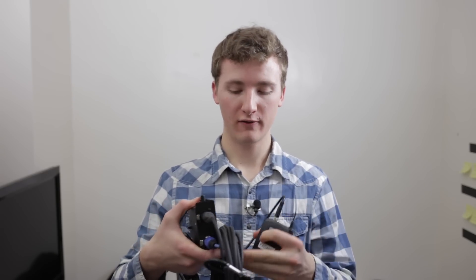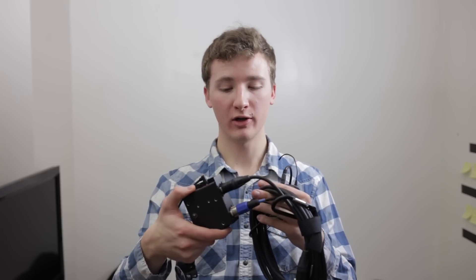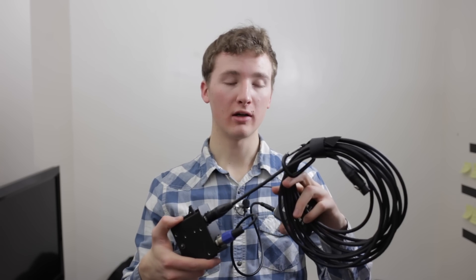It sounds great that way. You can dial in and adjust the sound and monitor it through the 3.5, and it works great for the ceremony. If I'm running the G3 to the officiant and they have mics and system sound, I can patch in on the other side — Sennheiser into the left channel, and on the right I run XLR using connectors to RCA or whatever their mixer board has. So I get clean wireless audio from the officiant and also record line-in from their mixer.